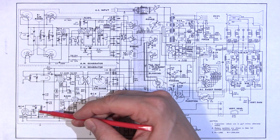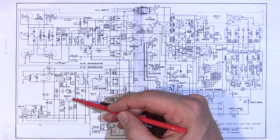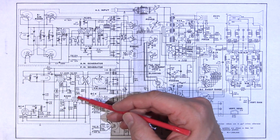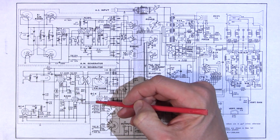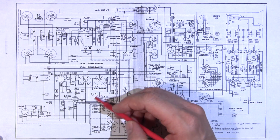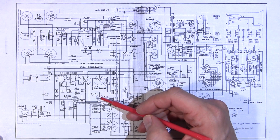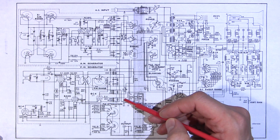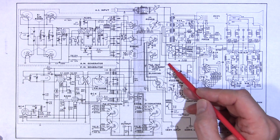This fixed oscillator signal is also coming up through a 3.3 picofarad capacitor into this line, and again it's getting mixed at this tube. We have the signal available at the plate, and that runs out this shielded piece of coax and down into the FM attenuator network. Here we have a blanking feature which allows us to do our blanking. So now this is a 6C4 tube, and it's controlled by an AC winding on a transformer here, and this is our little phasing and control network here.